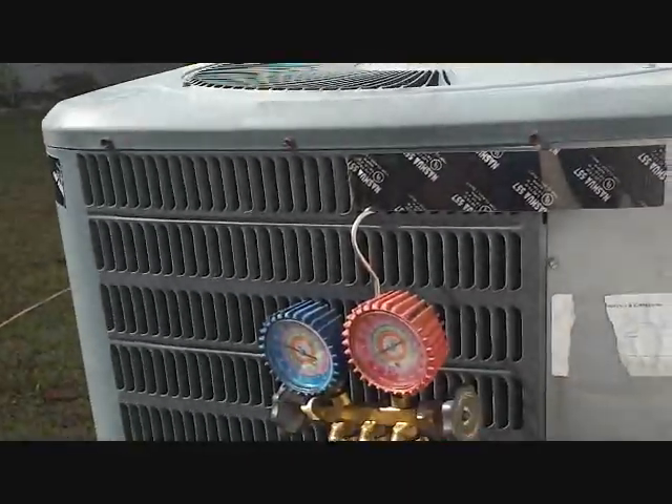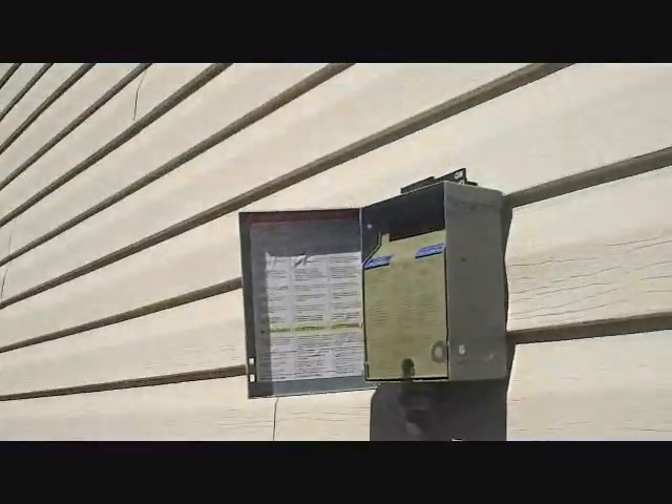Just a little deterioration here on the galvanized plates — looking for formicary corrosion. So I guess now we'll move on to probably the accumulator, the heat charging port outside. I've seen those leak as well. I'm really surprised. We'll move on out there. Took the top off; we're about to check inside to see if we can find the leak. Pull the power — I've got a little tape on the Goodman unit here because the wires tend to flop out when you take the top off, so it kind of holds them in place.